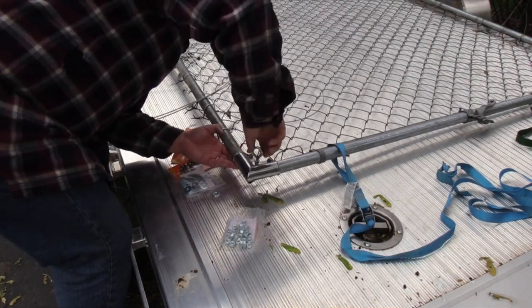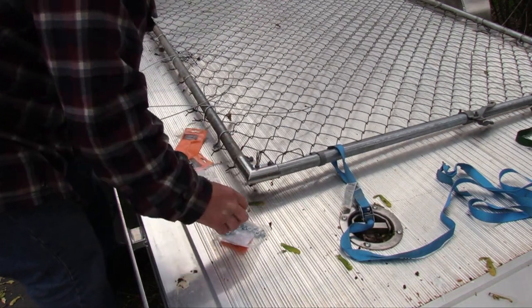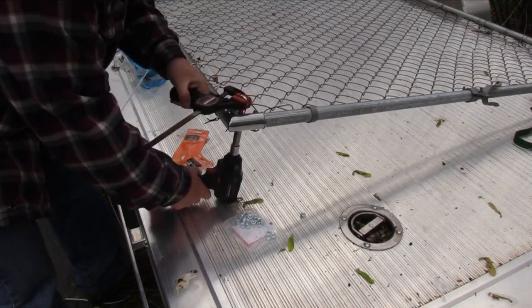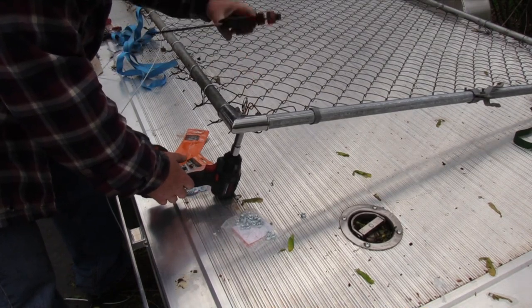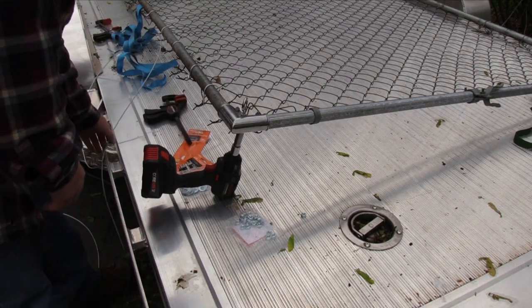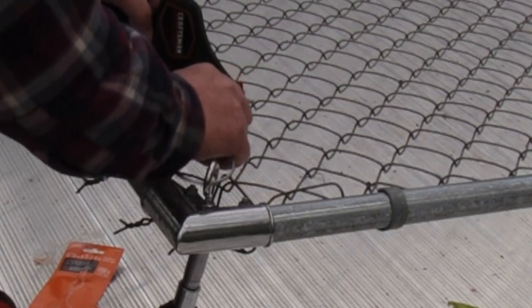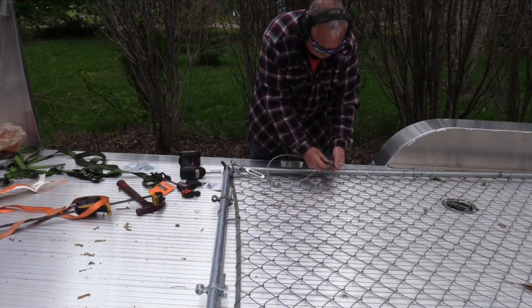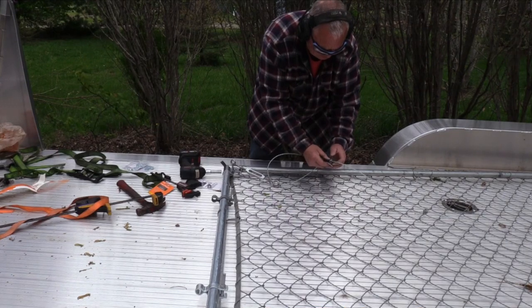To help support the long end of the fence I am installing a tension cable and I'm installing an eye bolt to attach it to the corner bracket at the opposite lower corner. It's very important the tension cable be attached from the upper hinge corner to the lower latch corner to pull up on the far end of the gate. The cable is being threaded through the lower eye bolt and temporarily clamped with a squeeze clamp. The turnbuckle was attached to the upper corner so later when the adjustment needs to be made you don't need to bend over.